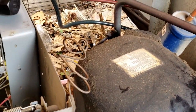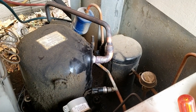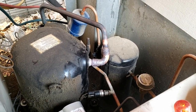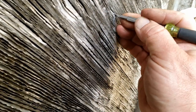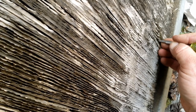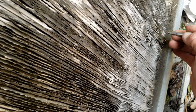We pumped it down, took it to zero - maybe a pound or two above - re-brazed that suction line, and left it vented a little bit just in case of any pressure buildup. Right now we're straightening out these fins. This is at a school so kids are around it quite a bit. We're going through patiently trying to straighten these out as best as possible - hasn't been done forever. That's the original compressor - I thought it was a replacement but it's an '03 compressor.